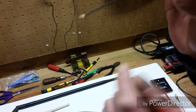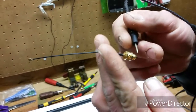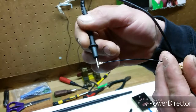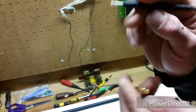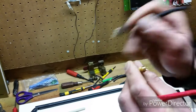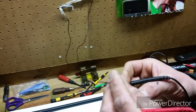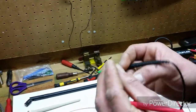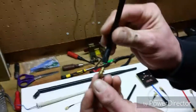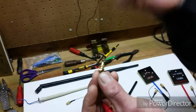If you don't have continuity between the outside ground threads and the outside of the IPEX, or between the inner pins, you have a bad wire. Even if you have the antenna hooked up, you're going to have no signal going to your antenna.